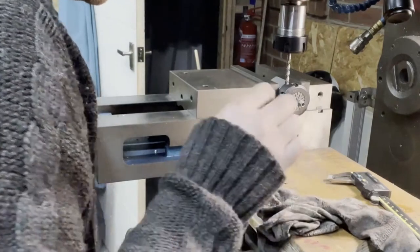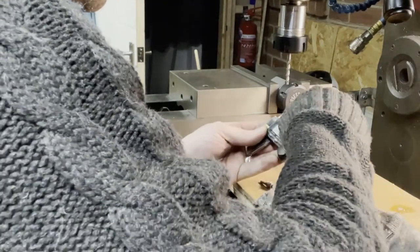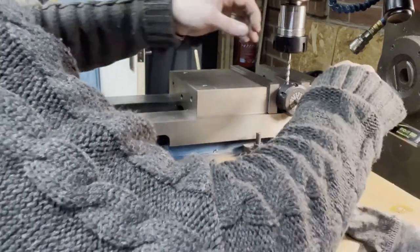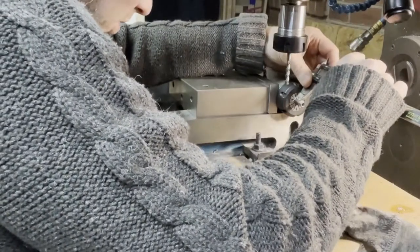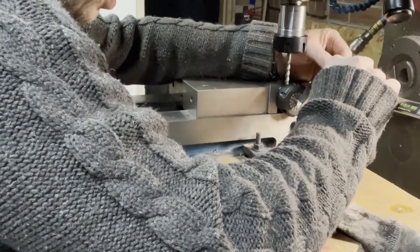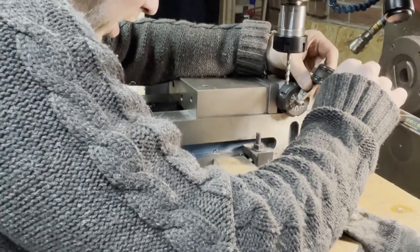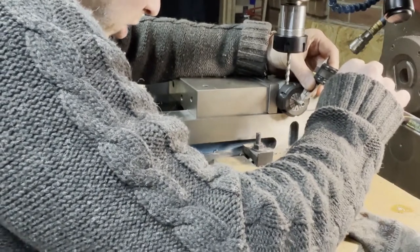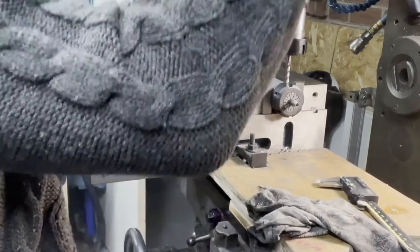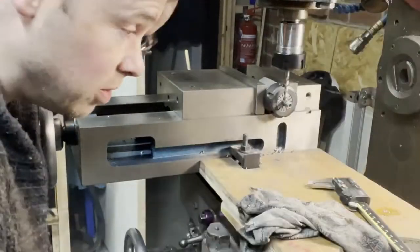Oh, that's got a round bit. I think I might go a little bit narrower and go up to the shoulder on that one. Do I want to leave it? Yeah, I think we do. I think it'll look a bit neater rather than needing a big flange, which is a mil. Oh, 1.05 to be exact. Let's split the difference. Let's go 1.5. Again, this is not functional, this is more aesthetic, and without putting that extra little curve on, trying to make it look at least a bit similar to the existing part. Bring that down. Oh, where are we going?